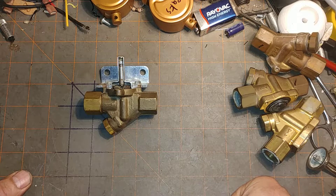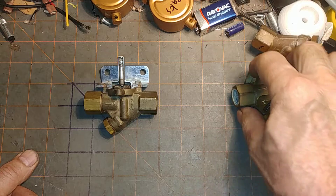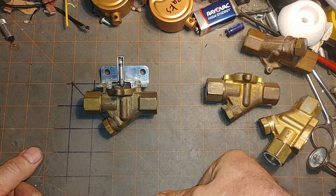Usually in my experience, if you have an automatic water feeder — I don't care whether it's a Unimatch or VXT or whatever — they all contain this valve, and what will happen is that the valve will stick open and cause flooding.